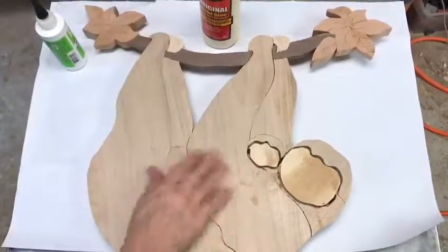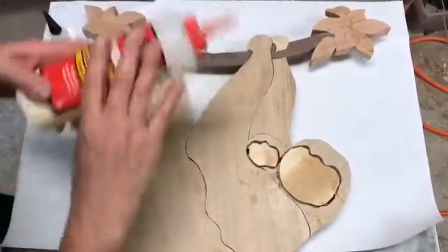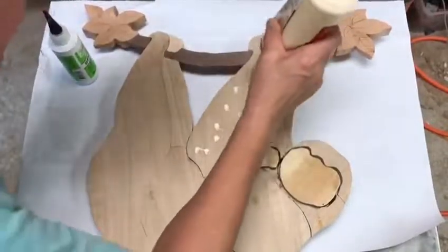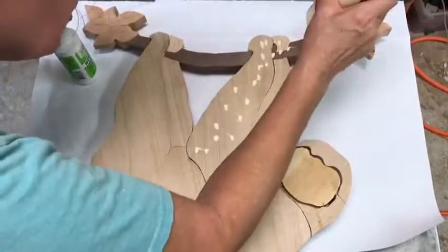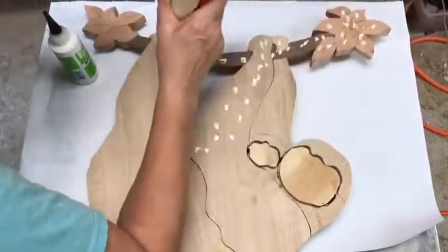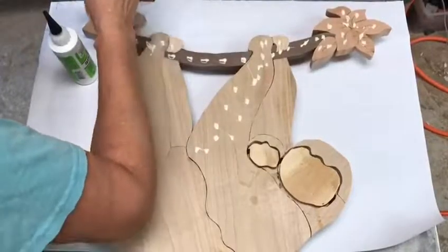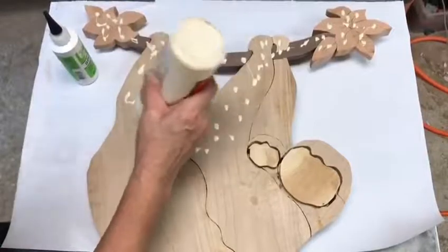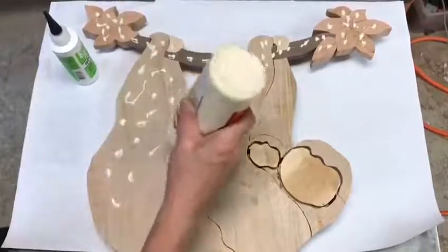Then I'm going to put wood glue and CA glue. The wood glue will cure overnight and the CA glue will hold it in place pretty much clamping it — a real nice method for finishing up your piece very fast and very permanent.